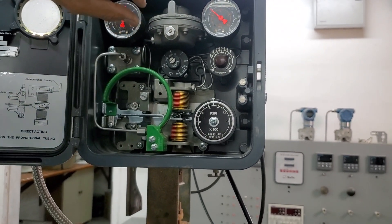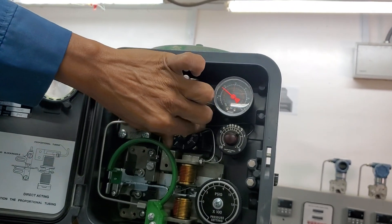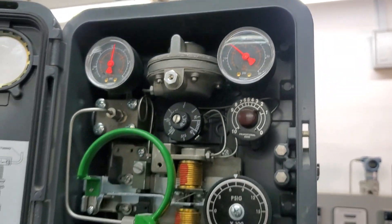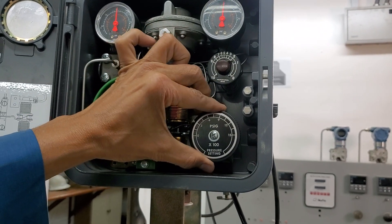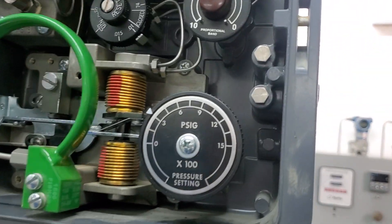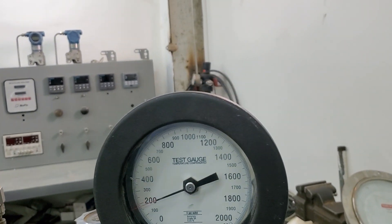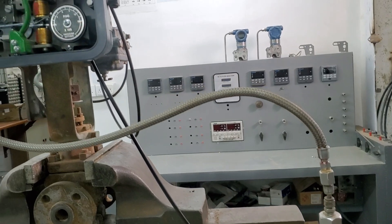My output should not change. I will open it — it stays at 18 PSI. If it stays at 18 then the calibration is done. All I need to do now is set my setpoint to 300 to test whether the controller is functioning. The reset is now fully open, and I lower the process pressure to zero first, then bring it back up to 300.